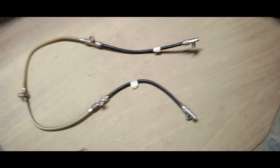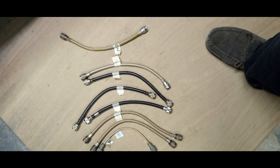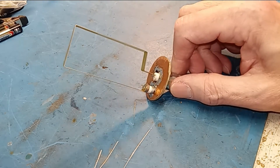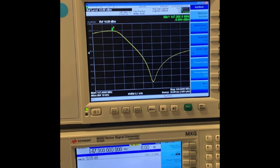I also made up another coax harness with the length of coax suggested by Kevin and measured the insertion loss and notch depth. The interconnect cables are supposed to be one quarter wavelength, and accounting for the coax velocity factor should be about 14 and a half inches. I tried a couple of different cable lengths and discovered experimentally that the duplexer worked a bit better with shorter than anticipated cables. It turned out I was getting the best performance with one foot, or 12-inch, cables. There seems to be some additional capacitive loading from the coupling loop tuning that skews the cable length in some way. The 12-inch cables provided both reduced insertion loss and better notch depth as measured on both spectrum analyzers.